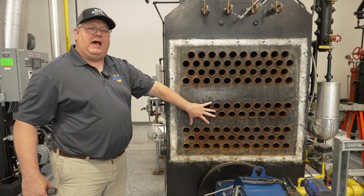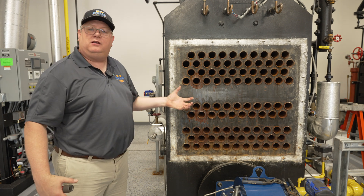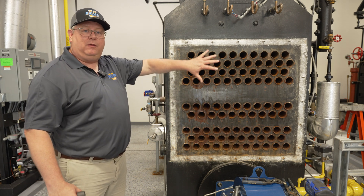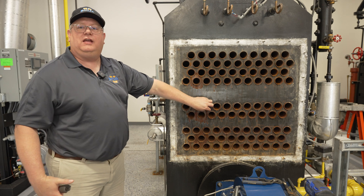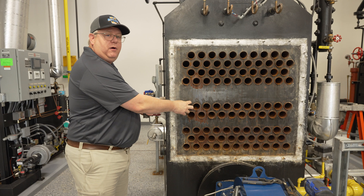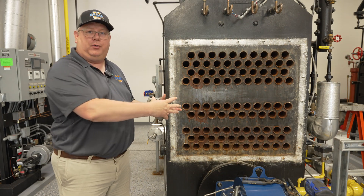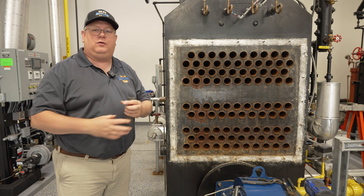On the back of this pass where the main flue gases turn and come back to this end, we have a beaded tube end like we saw on the Victory earlier. But since this is on the outlet of the second pass and the beginning of the third pass, the flue gas temperatures here are not high enough to actually damage the end of these tubes, so we just use a simple flare. This tube is rolled to form our seal and then flared. The flare is essentially there to anchor the tube so that if there's expansion and contraction, it can't be pulled or pushed through the tube sheet. The bead on one end and the flare on the other lock that tube between the two tube sheets.